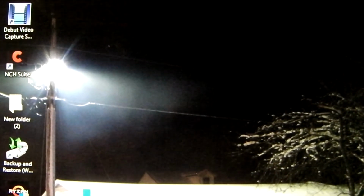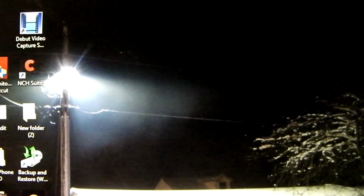So with heat pumps that have demand defrost installed, many times when it's cold outside and the humidity is low, at the point where a time temperature defrost control board would put the unit in defrost, the demand defrost will say, okay, the coil is fine, I don't need to defrost, I'll just keep running. And save you, the customer, lots of money on your electric bill. So yeah, heat pumps, as I mentioned, are pretty neat systems, and when they're properly installed, they can save you quite a bit of money on power usage.